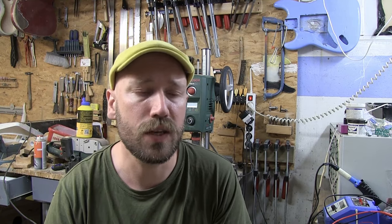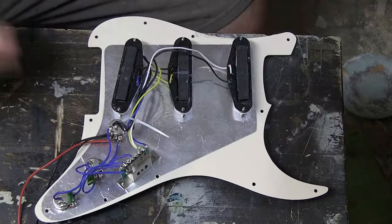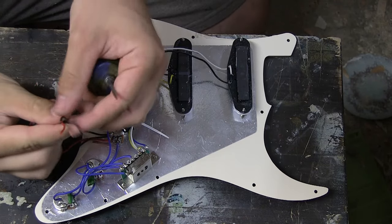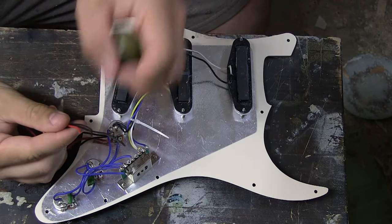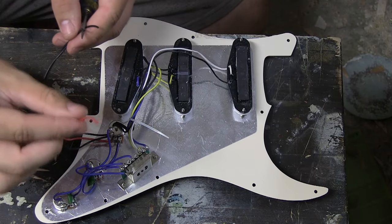Check if there are two wires going to your jack — if there is only one, you have to re-solder the cable that is there, and most likely replace it with a longer wire. You will have three wires that are just loose: two of them are ground wires — one for the jack and one for your bridge — and then you will have a lead wire that is for your jack.